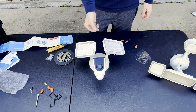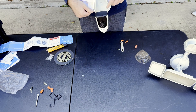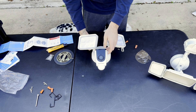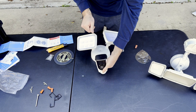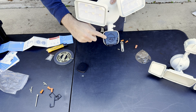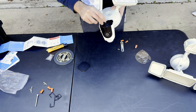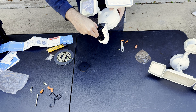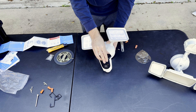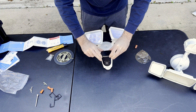We'll come back up with the light. Before we hang this camera we're going to put in an SD card. You might not want or need one, but I'm doing this because while I trust Frigate it's always nice to have a backup. We're going to twist off this top plate of the Amcrest camera — it pops off and there's a little SD card slot right here. I've got an extra 16 GB SD card, pop it in there, put the cover back on, and make sure it's on good so it's watertight.